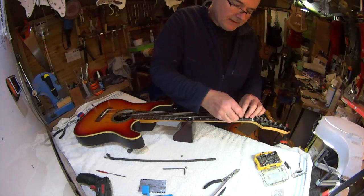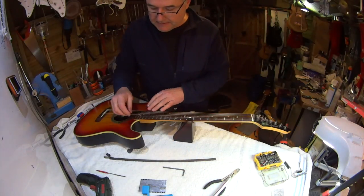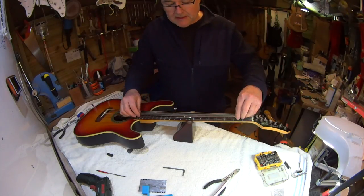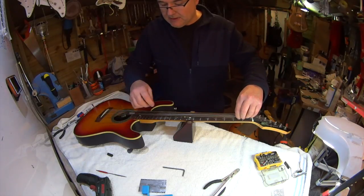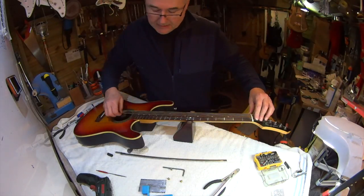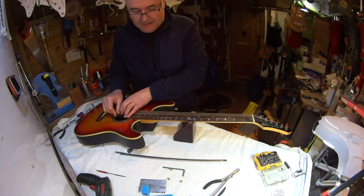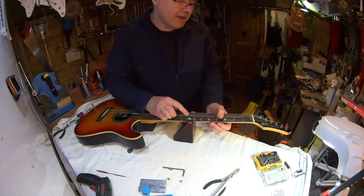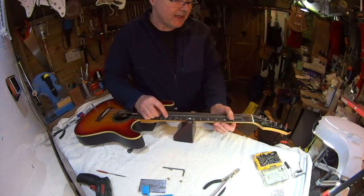Now, because I've moved over, I'm going to recalibrate again as I head for the G track. And you can do this, A, because the bar changes a bit as you use it, sometimes, like I said, the rod gets turned accidentally and it changes the curve slightly, but also because the relief curve can actually change as you move across the neck. So towards this side it can be a little bit different. And so recalibrating is the way of ensuring that we follow any changes.